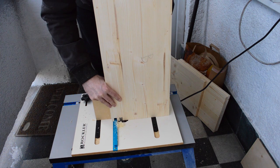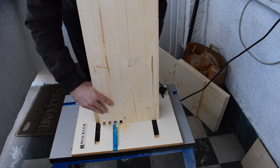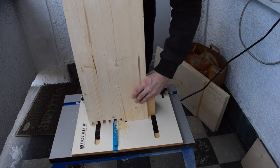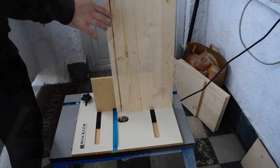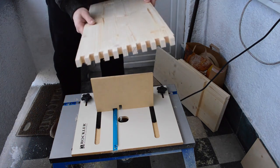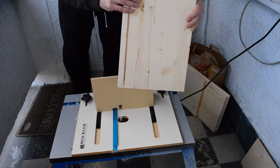The way I like to make them is to pick two boards which are the same and then just cut them with one edge aligned to the aluminum indexing key on the right side of the Rockler jig. When you flip the board, make sure that you are cutting the same finger so that the boards are symmetric.